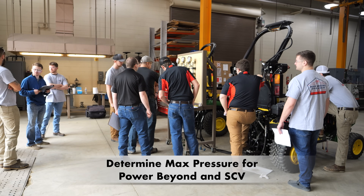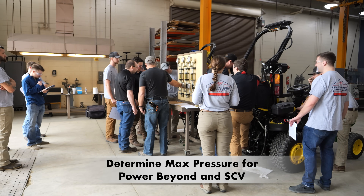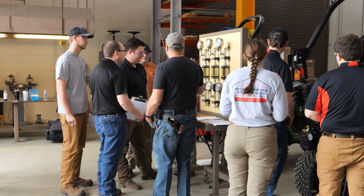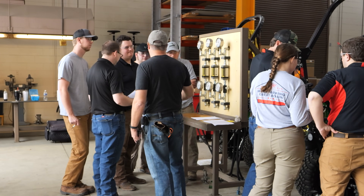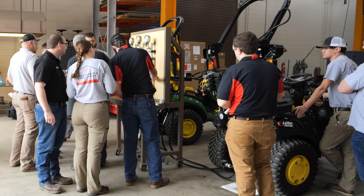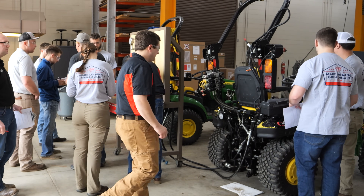So there's your max pressure — 2,000. Give her full throttle. So about 100 PSI difference. We ran it through the SCV, not the Power Beyond, when we did it, because we thought it would be the same. Look at that number — 2,100. Then idle it back down and look again — it said 100 PSI. They were running through the valve; we ran through the valve. Fair enough. Think about it — why? We just proved in a picture over here it's irrelevant. It's the difference between picking up that log and not picking up that log. We saw 2,100 at max throttle, 2,000 at idle. The question is why — we just proved on the board that it should be no different. Discuss among yourselves and see if you can figure out why.